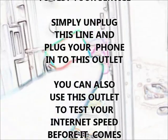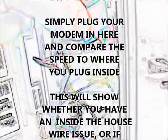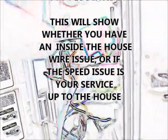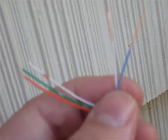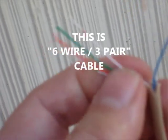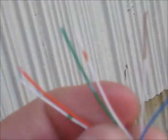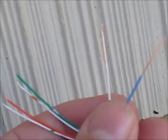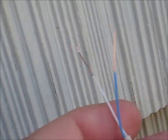What you're gonna see is this connection plug here — that is simply a wire that plugs into this side of the box, and the other side has these screws. The cable I have is what they call six wire: one, two, three, four, five, six — six wire, three pair. I'm only going to use two of these because I'm only going to put in one phone line.